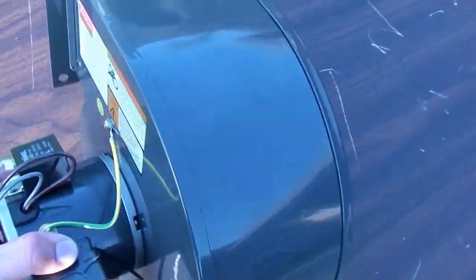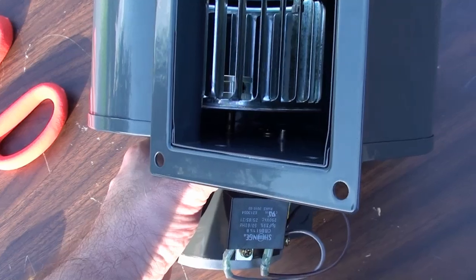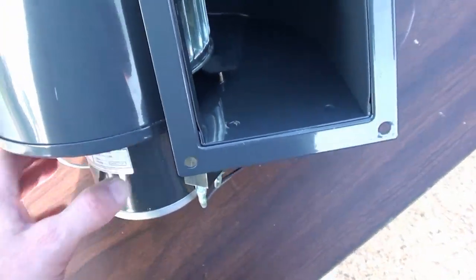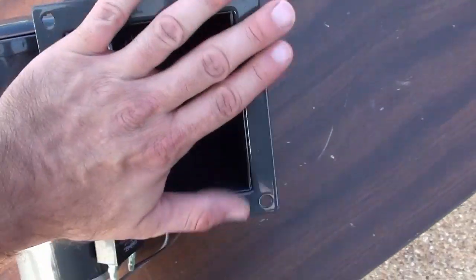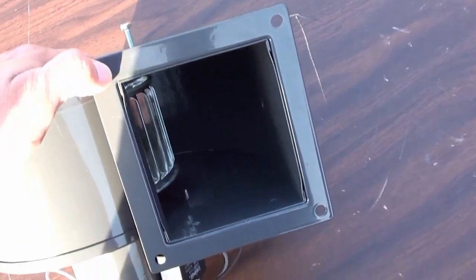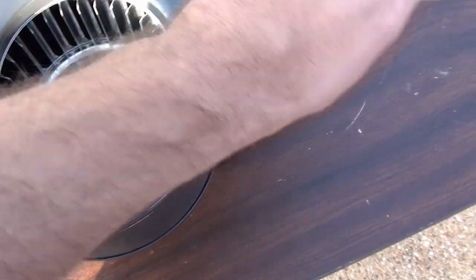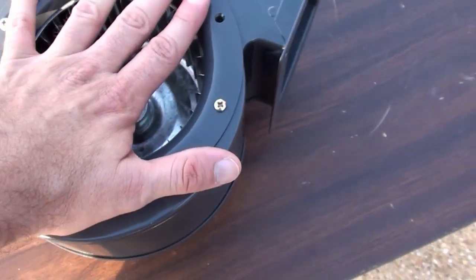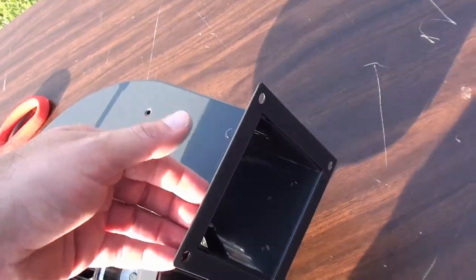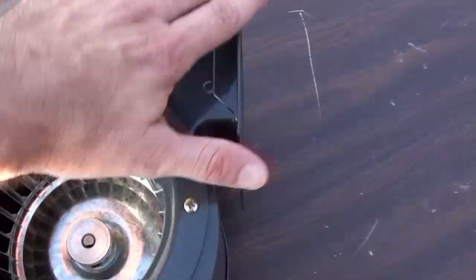Here's the new fan — you can see the motor is outside the airflow like everyone says it should be. It's not an explosion-proof motor, but since the motor is outside the airflow that should take care of that issue. Here's the exhaust vent: they don't sell any flanges to work with standard dryer duct, so you're supposed to build one yourself. Here's the air intake — it's going to bolt on the side of the cabinet, but the flange is too close to the intake to give many placement options.